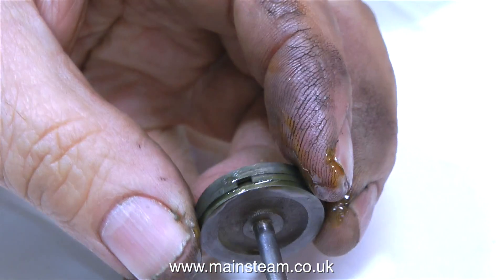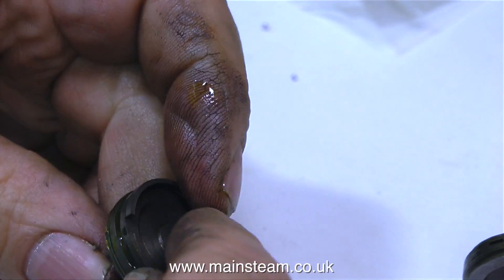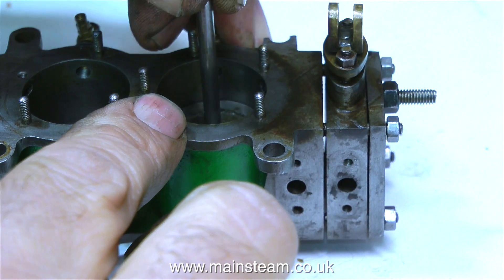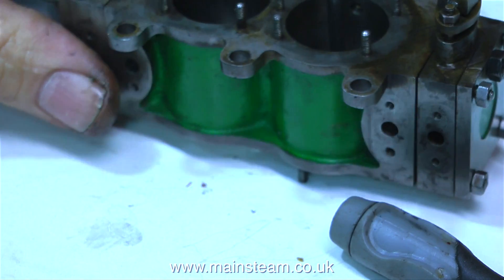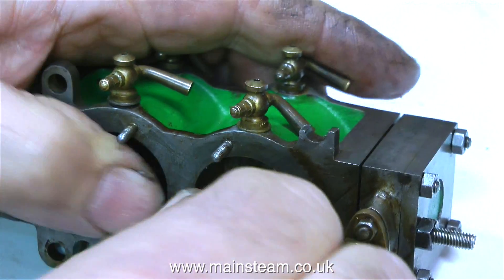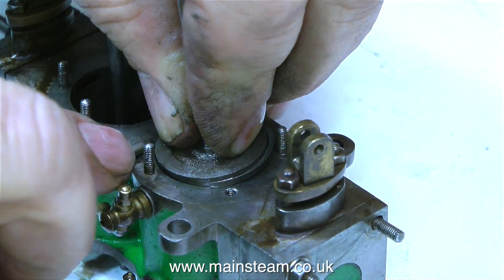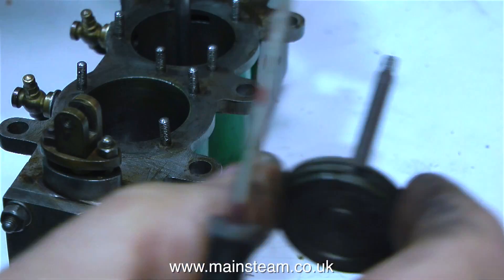There's just one variable that I am worried about. When I received this engine from the owner, it was in pieces — just a box of bits. The piston rings were there but they weren't fitted to the pistons, for obvious reasons: they were too tight. And it really is what I thought it was going to be — the piston rings are too tight to fit in the bore. So what I'm about to do, in the next episode perhaps, is have a look and make sure that the bore is the right size. One assumes the piston rings are one inch in diameter, but if the bore is a little bit under that, I'm going to have to ream it out so that they fit. If the pistons are tight in the bore on an engine of this size, you have a problem — by the time you're running the pistons, other parts of the engine are worn out, like the big ends, the little ends, and the crosshead. So it's a good idea to try and get it right to start with.